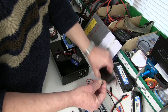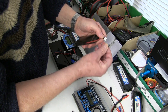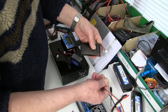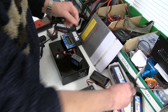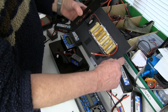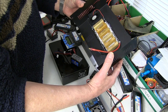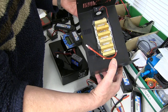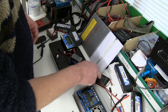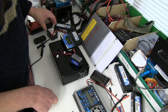If it's a small battery like this, I can discharge it with a 6.8 ohm resistor — you put it across the plus and minus and it will discharge it. With a bigger battery like this, you're going to need a low resistance, like a discharger. Here's a bank of resistors which is less than 1 ohm in total and draws a lot of current. You can put it on that until you get it down to zero, though you have to leave it on for a few hours.